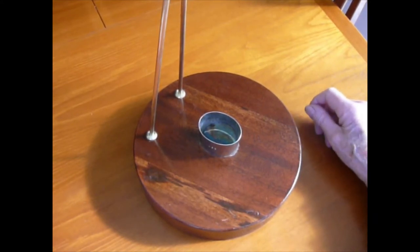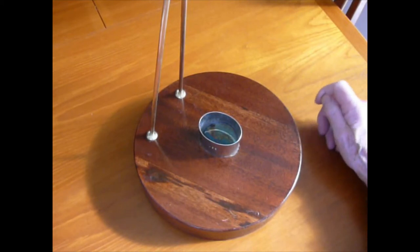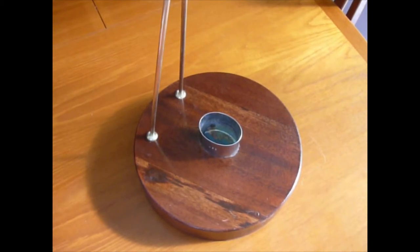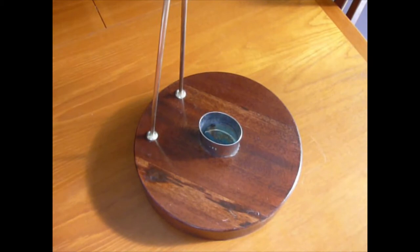half an inch thick. And if you've ever drilled lead, well, that's a great way to break drills. If you've never drilled it before, go slowly and make sure you clear the flutes, because it breaks quite the biggest of drills, I can assure you. Anyway, I screwed it in. It's firmly fixed in the base.